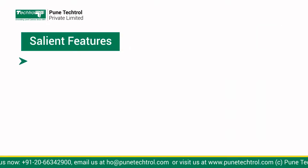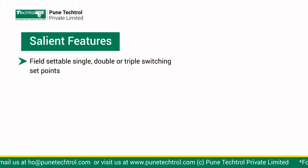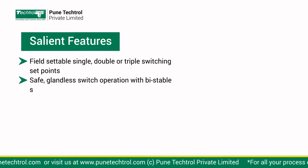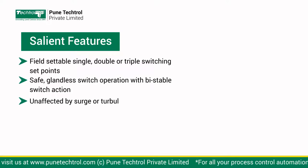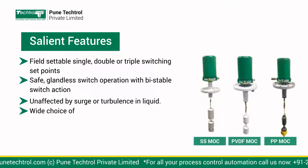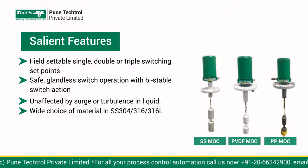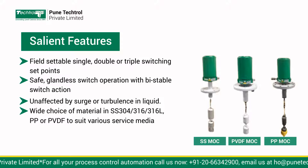Salient features: field settable, single, double or triple switching set points. Safe, glandless switch operation with bistable switch action. Unaffected by surge or turbulence in liquid. Wide choice of material in SS304, 316, 316L, PP or PVDF to suit various service media.